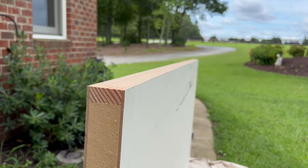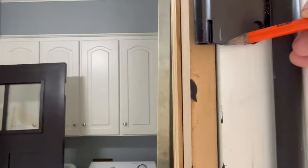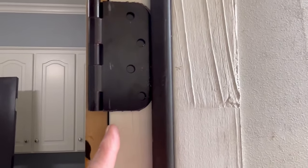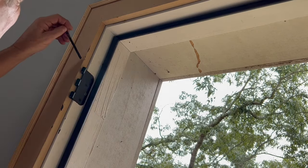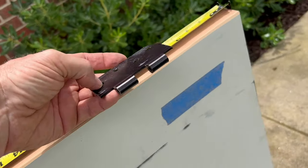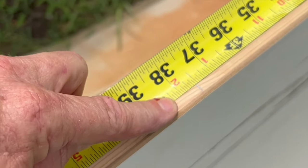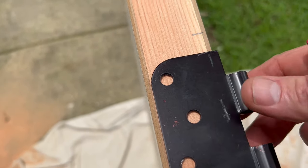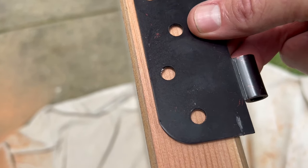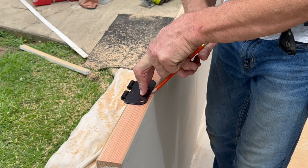When it's real close to the line, just stop and put a nice bevel on it. Before taking the hinge off the jamb, make a mark where the edge of the jamb is — we want the edge of the door to align with the edge of the jamb when installed. Take the hinge pin out and remove that half of the top hinge. Check measurements — six and five eighths, 37 and 9 sixteenths, 68 and 9 sixteenths — place the hinge at the mark, align with the edge of the door, and trace the hinge.